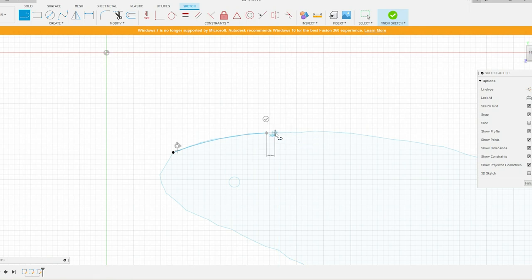Now we have another option. We can go along and do another small line. Because if I just hold and click this, it's going to create a short line, and then it's going to make another curve that comes out from that other line. In this case, that works out okay, because we can more or less follow the curve of this. But the other option, if we didn't want a little line segment there, is to press escape, and then go back and select our line again, or hit L, and then drag and hold again. And that'll give us another curve that we can work with.